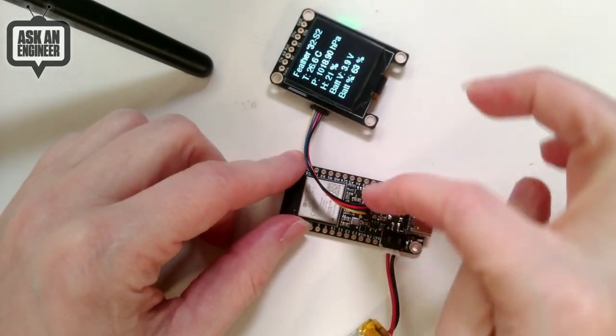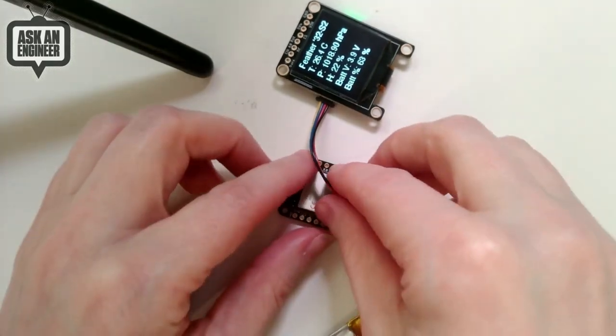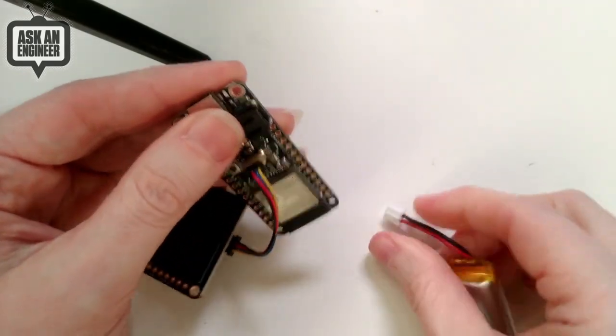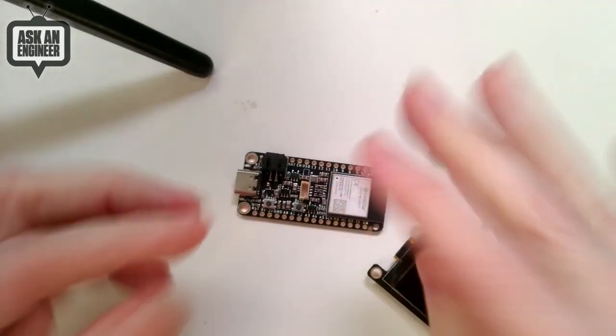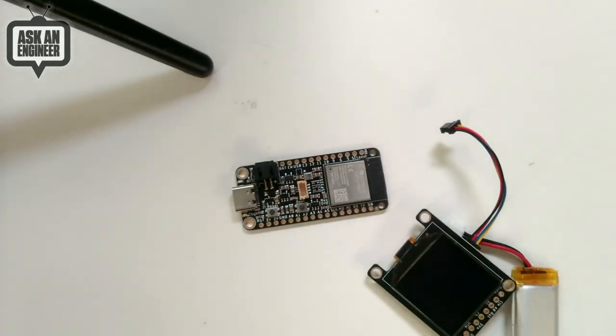So the big change really was just, again, that little LDO over here just got updated so it can be lower power in low power mode. So the guide will be updated with the new schematic, but otherwise it's very functionally similar. The polarity of how to turn on and off the power for the QT port did change. We're going to have a little chunk of code that, no matter which version you have, it'll turn it on or off as desired.